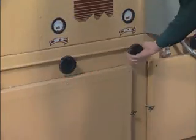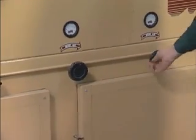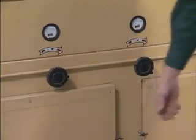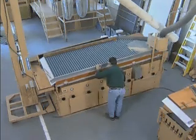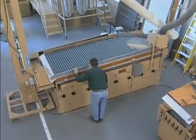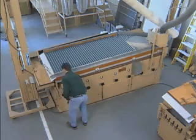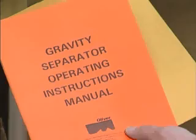Too little air will cause the material to appear sluggish and pile up at the high side of the deck. Air is adjusted by turning the more air control knobs clockwise for more and counterclockwise for less. There are roughly 90 revolutions of the knob between a closed air gate and a fully opened air gate. Many of the initial adjustments must be made soon after material is fed onto the deck. Therefore, it is a good idea to operate the machine empty for a few minutes, making some preset adjustments. Presets are recommended on page 12 in your operations manual.